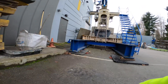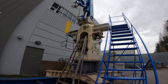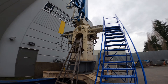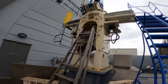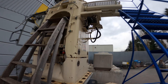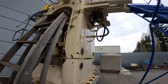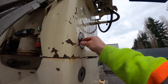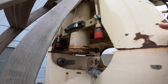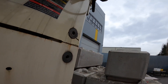Before we say goodbye for the day, I want to point out something about this new RS850 Putzmeister tower — this is more my brother's thing, he's our placing boom guru around here. My experience is admittedly limited but I'm trying to get him in a video — he's a little camera shy but I'm chipping away at him. Rather than the old pin tower stuff or competing brands of placing boom that use a whole bunch of bolts that have to be torqued to something like 1200 foot-pounds — which can be really time consuming piecing the mast sections together — on this Putzmeister they use pins that knock in and retain at the back with retaining clips and two bolts. Makes it so much quicker and easier.